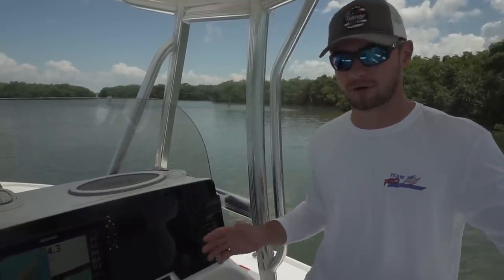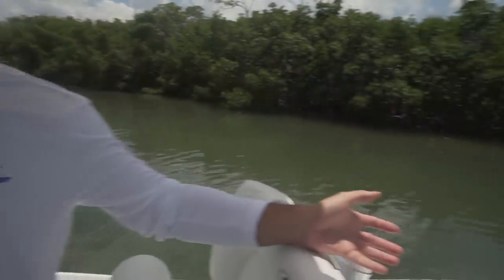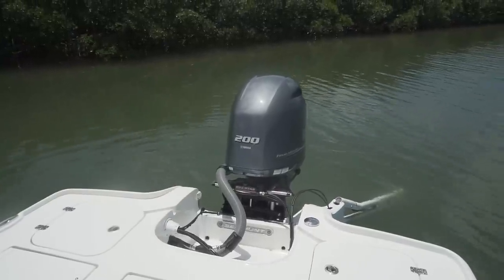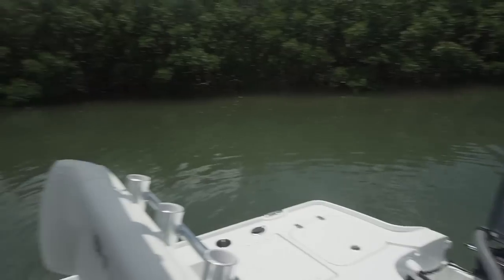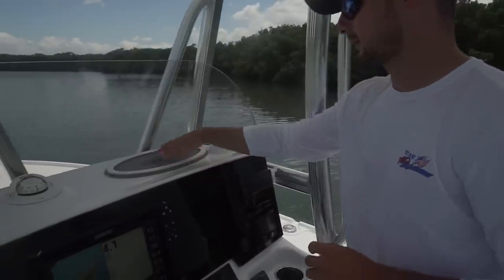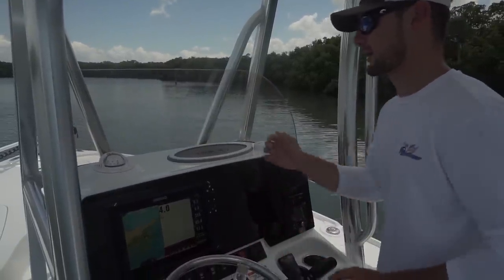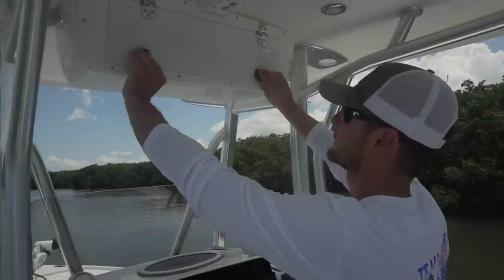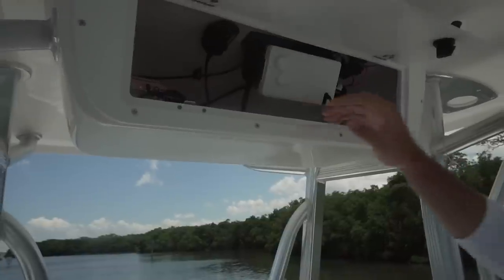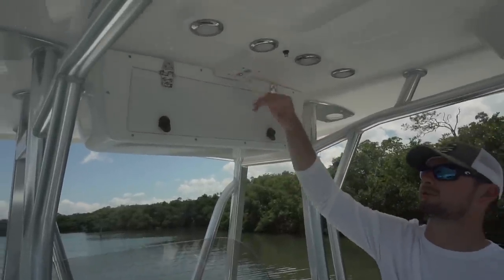Something we made sure to get with this boat is this jack plate right here. On this boat we have a six inch Sea Star jack plate. All it does is raise and lower the engine itself, which will help us get up on plane and not scrape bottom while we're on plane in shallow water. We also got a little storage area right here so we can put keys or anything while we're sitting there fishing — it's got a little lip on there so things aren't going to fly away while you're running. Up at the top of the console on the T-top, got our VHF radio and Simrad right there, plus a bunch of storage — extra keys and remotes for the boat lift.